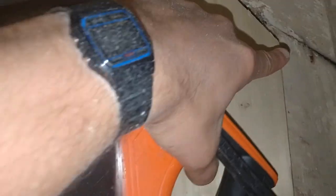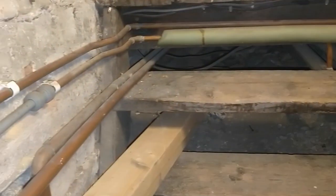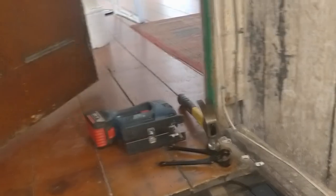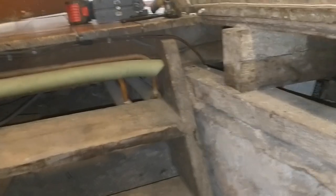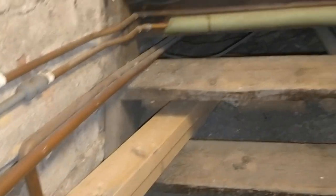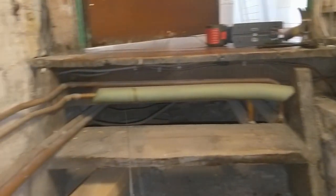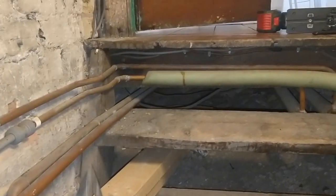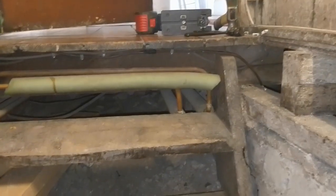I've finished cutting this to length and size. I've left a little bit of extra length here, and although the height there is right, I might need to chop a bit more off. I've never owned a reciprocating saw but now would be quite a handy time to have one because I've got to take this whole old staircase out. I'm going to use old-fashioned tools - crowbar, mini crowbar, hand saw, and maybe a jigsaw. The angle here is catching at the top point, so that old staircase has to come out. Got to be careful of the pipes, which are actually resting on that top step.